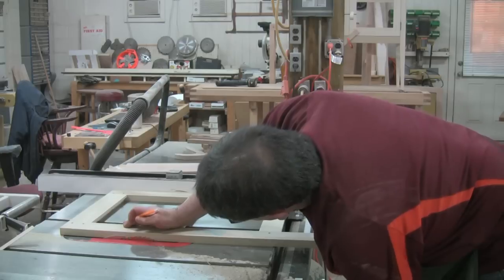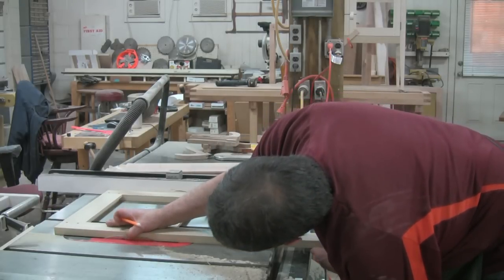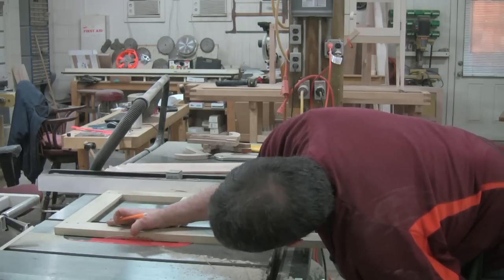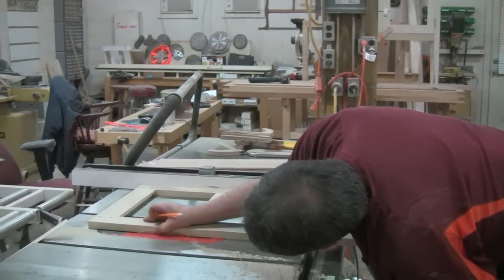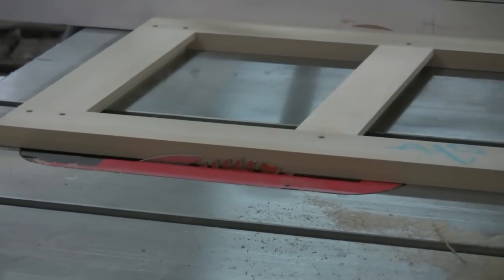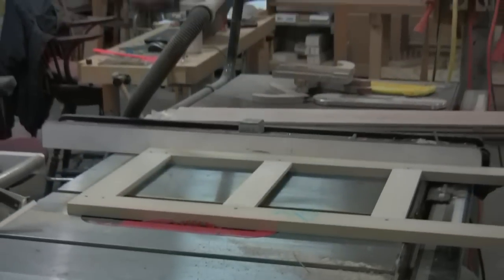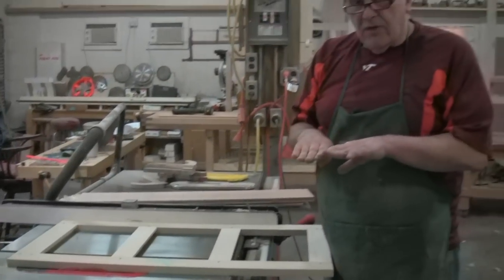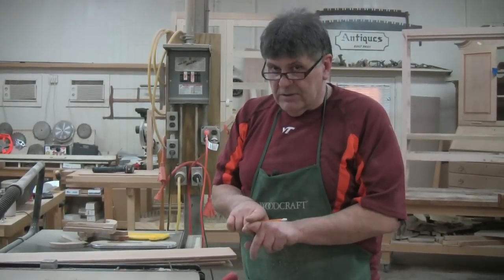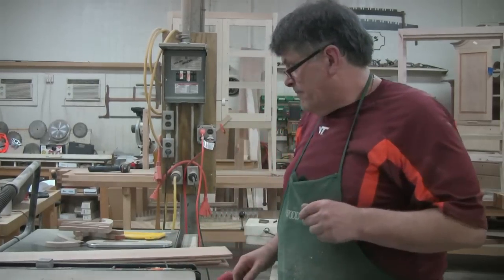I'm going to lower this blade and I want to rotate because I want to make sure that this tooth right here, the highest tooth, is coming in right at it. Now, you don't need this to be 100% tight, meaning you want them to overlap, but they don't have to fit perfectly as far as depth goes. You want them close, because remember, you're going to be doing a little finishing there.